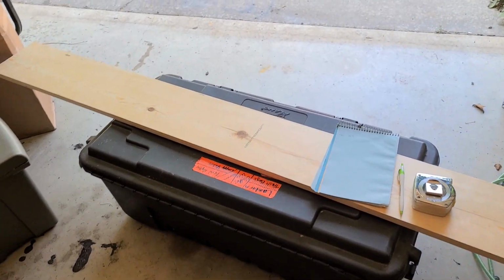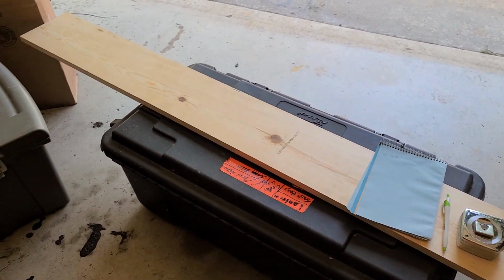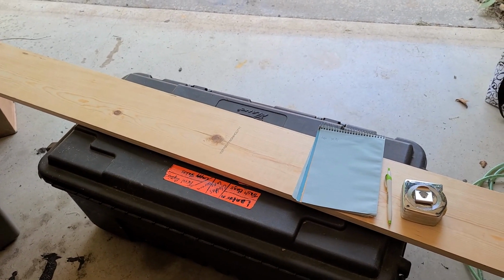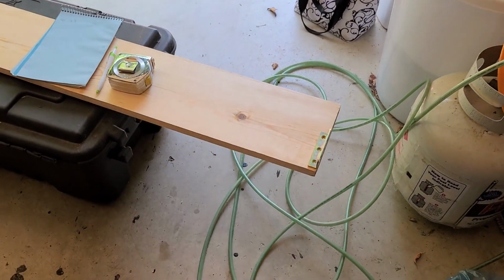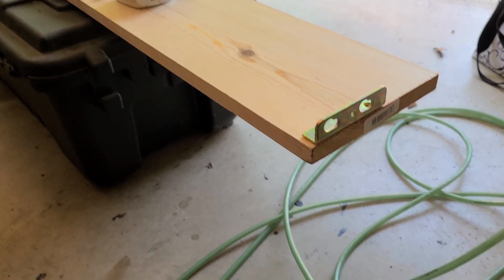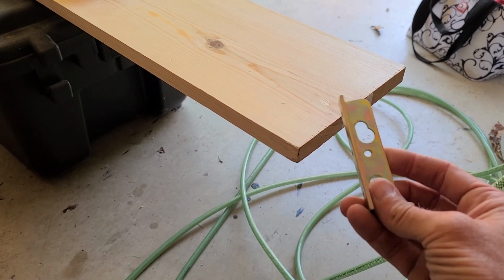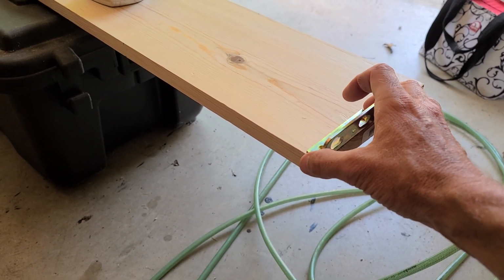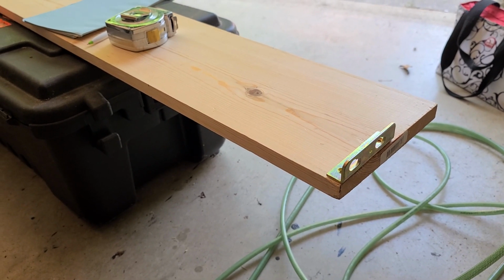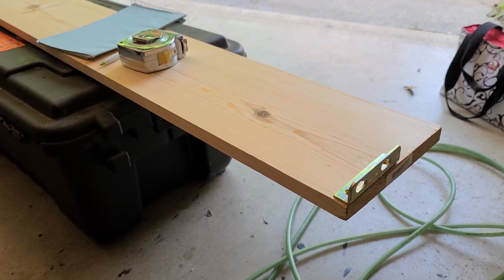One of the first things I'm going to end up doing is cutting legs. I'm cutting my 4x4 cedar beam to 18 3/4 inches long. That way I'll have my 15-inch clearance and be able to attach the connectors to it, and still hide those connections on those legs. So that's the first step. So time to get busy.